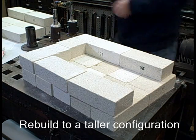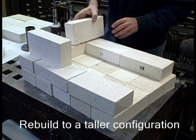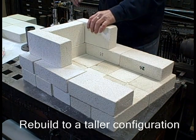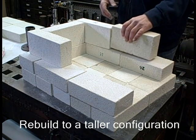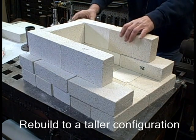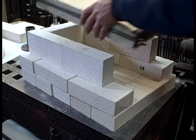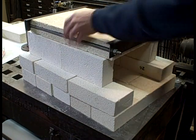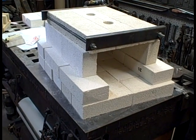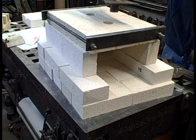We're going to build this up a little bit — make it two and a half inches taller. Think about how you're constructing these so that you have stability. Here I have a forge that's about seven inches high in the burn chamber and nine inches wide — that's a fairly good-sized forge. If I want to do long work, I just leave the back end open a little bit and stick the burner assembly in there.